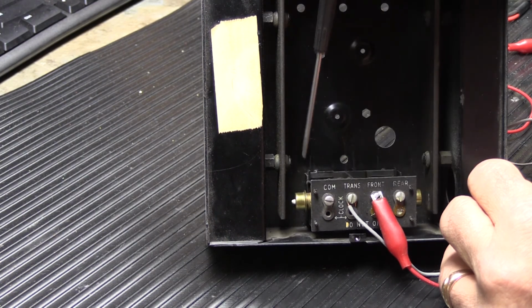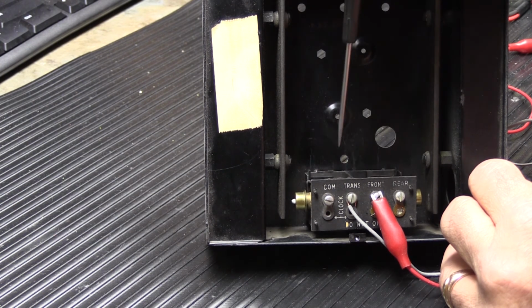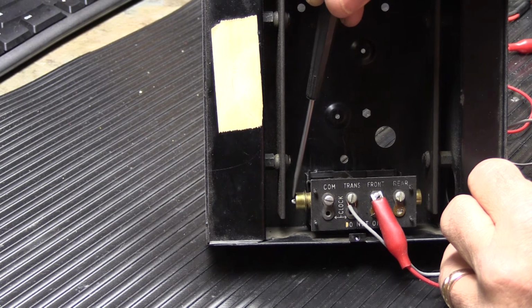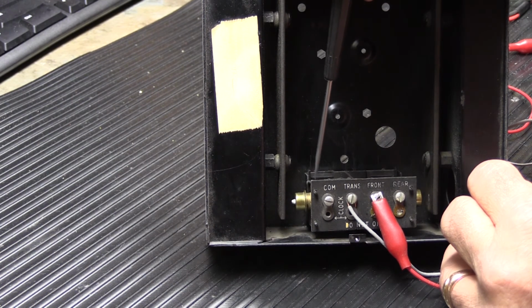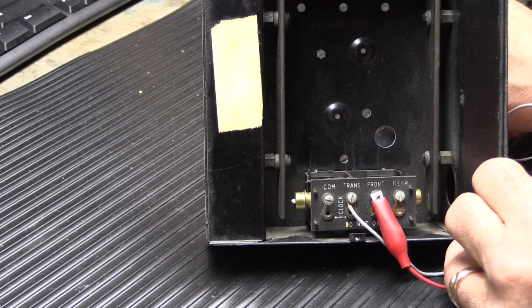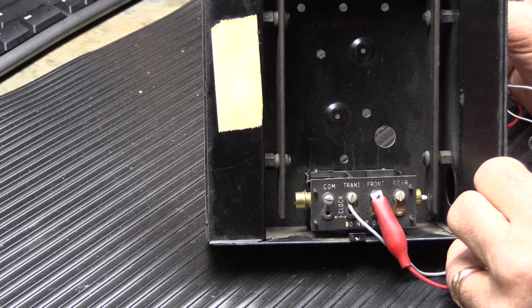left-hand tone bar. The little spring on the left-hand end, remember that's the short spring over here, that's been compressed also, because once this tip has hit the left-hand tone bar, that spring and the energy is gone, that spring is going to push the plunger back into the solenoid to the right just a little bit. So again, it's at its ready position. So when we push it, it's going to go to the right, and the spring is fully compressed.